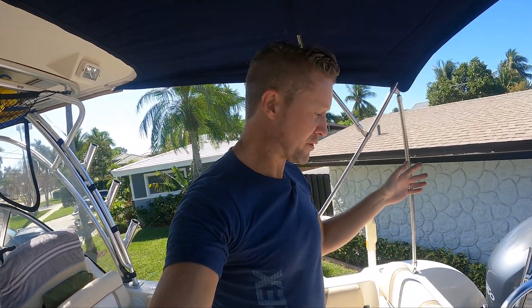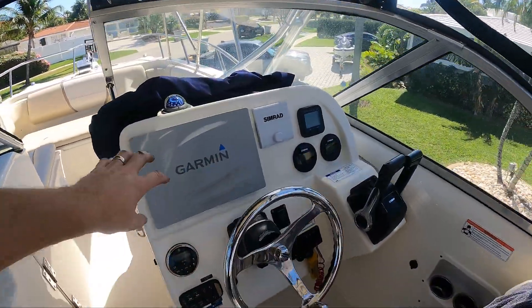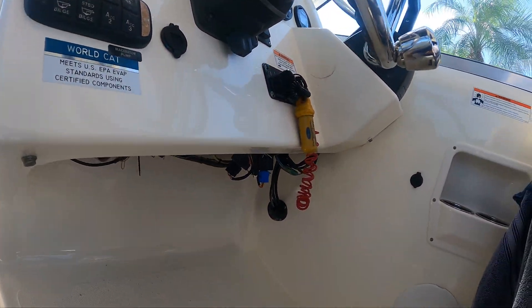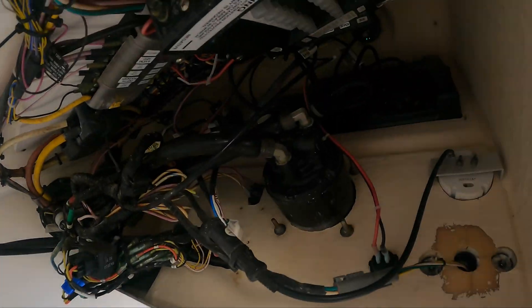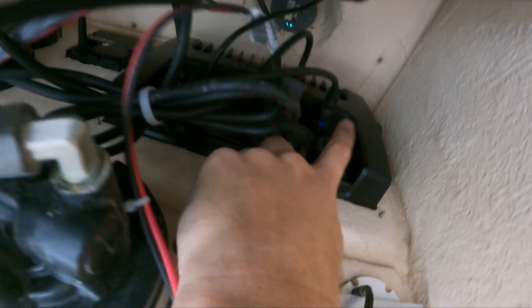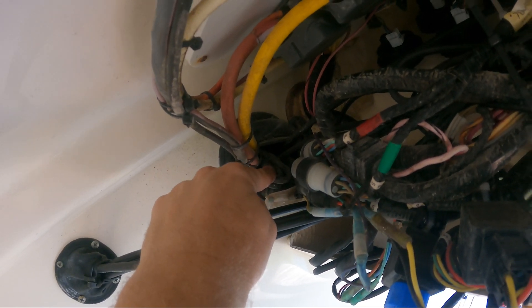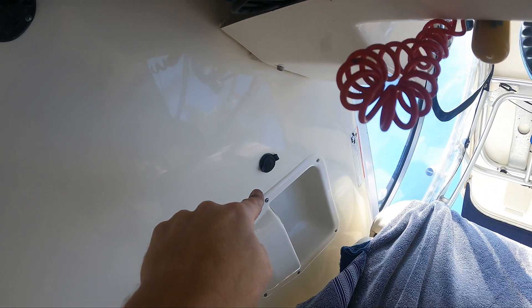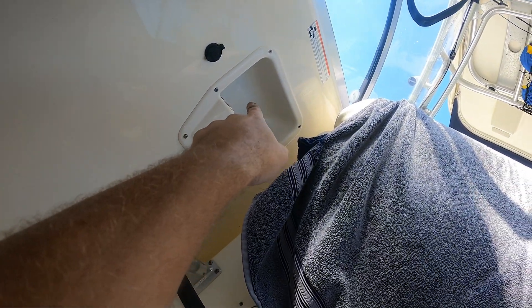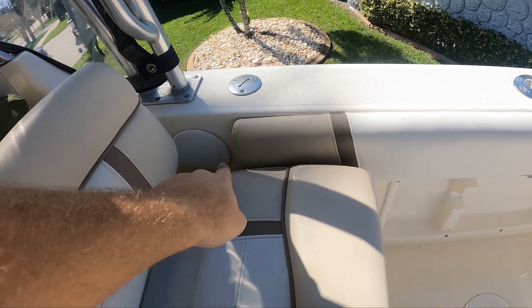With both transducers installed, we just have a routing problem — we need to get the cables from both sides all the way up to our MFD mounted on a station here. Going underneath, we can see the MFD and the actual port we need to connect to. We can trace wires and see where they're going, but we obviously need to come over the starboard side. There's an entry point for the loom and we may need to remove an access panel or the drink station to get through and fish the wires. There's actually another entry point that might make this super easy.